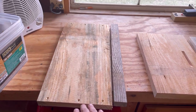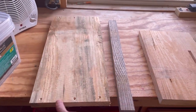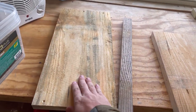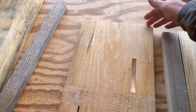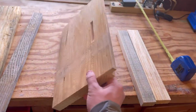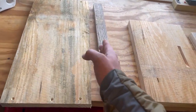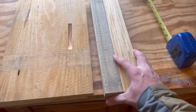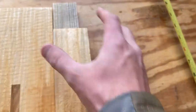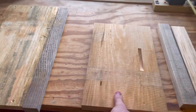I'm going to start from the beginning of how we get our pieces. This is our board for our 10-frame boxes — this would be your outside length and this is your outside width with a handle in it. Imagine that these are a 16-foot long board. The first thing we do is chop saw them to length, and the second we table saw them to width, which is technically the height of the box. Because I order a one-by-12, that is our scrap — and if you notice, this top piece is wider than the bottom piece because this board had more moisture in it and it shrank up.